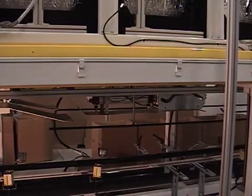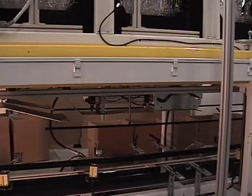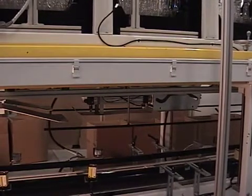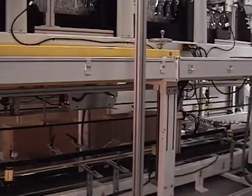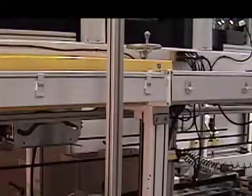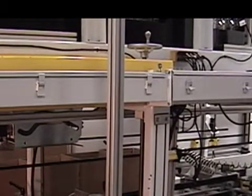A 10-inch wide rough top belt positively feeds the case into the elevator. An optional set of side grip belts are also available. If you want to run with the flaps straight up, we have redesigned the packer to run at 17.5 inches from the top of the belt to the underside of the flap opener to accommodate feeding straight up flaps to the elevator. A new Acme crank adjustment rod is used to raise or lower the entire assembly.